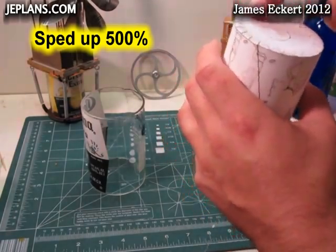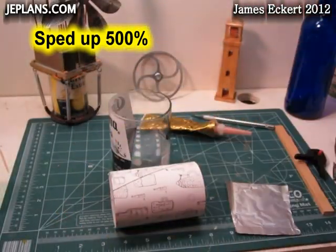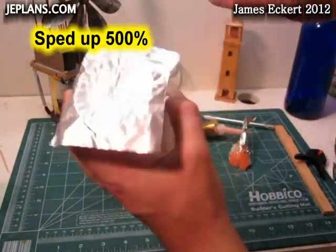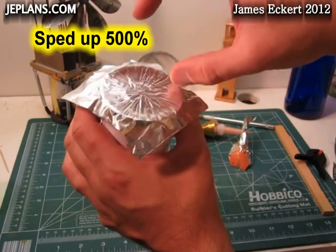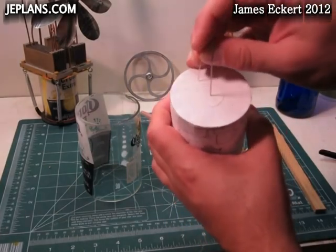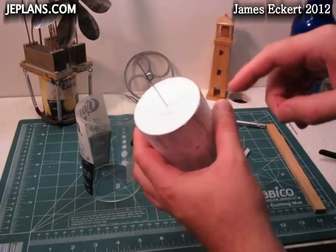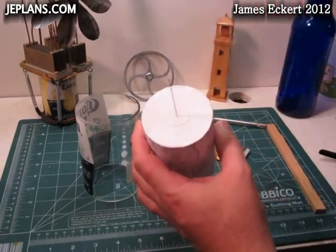A little touch-up. I put a heat shield on the bottom by attaching basic aluminum foil with some high temp silicone. The bottom's done, trimmed off. Now I'm going to poke a few holes in the top because they tend to be a little airtight once you're all done with them. When it heats up, it's going to blow up and kind of warp the top and the bottom outward — kind of like a balloon. So I just want to poke a few holes to let air in and out of the displacer as needed.